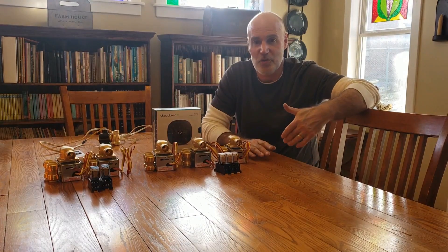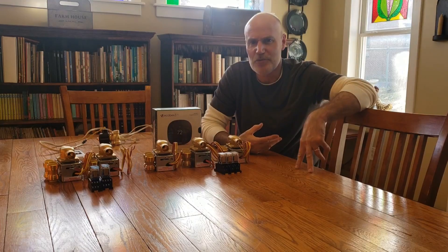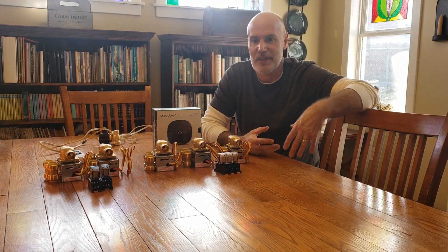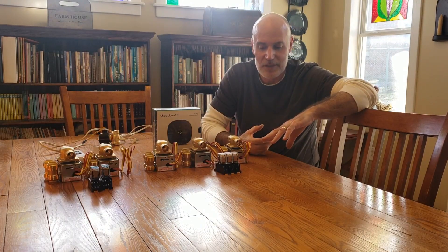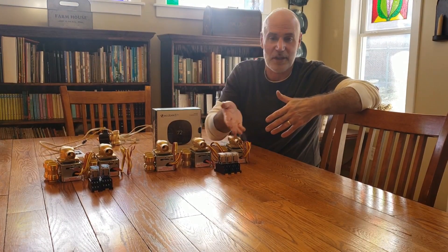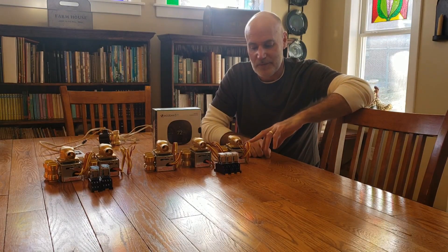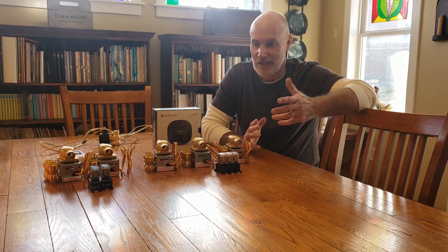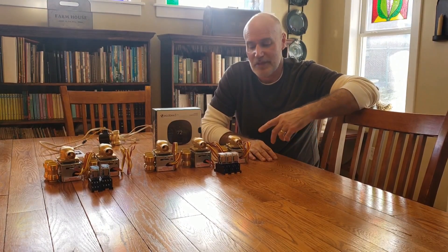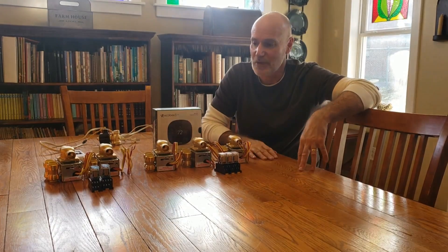That end-of-travel switch guarantees you won't turn the pump on unless the valve is open. But in my system, two zones don't have valves, so I'm never at risk of closing everything off. I also prefer routing everything through the relays for troubleshooting — I can just look at the relays to see if they're energized. That said, if your system could have all zones closed simultaneously, using the valve switches would be the right approach.